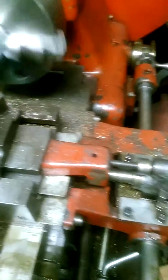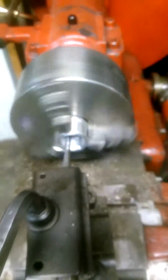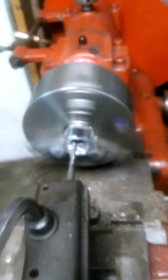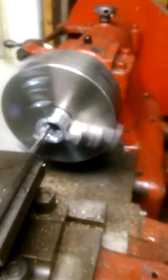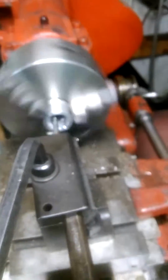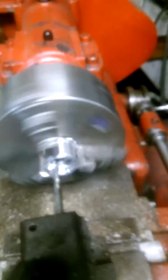This is a non-pressurized engine, so what that means is that I'll have to assemble this, split it, assemble it on the rod, put the shims in it, and then after that, you have to drill the holes through the web of the connecting rod into the bearing. And there's a hole in the bearing where that oil hole goes to in the shell itself, and that basically oils the bearing. If I can keep the parts from falling off.